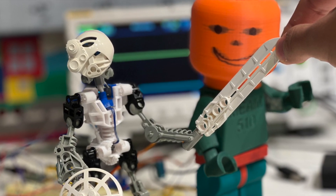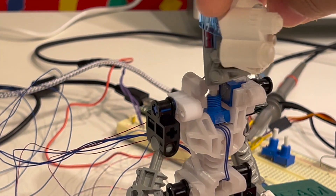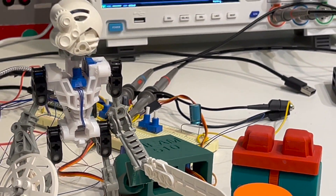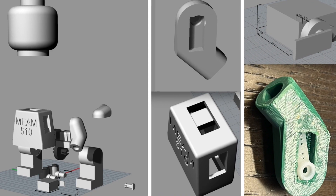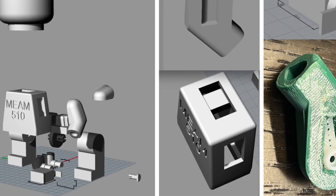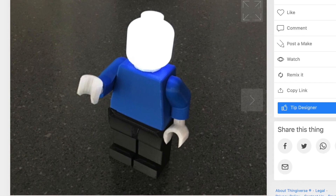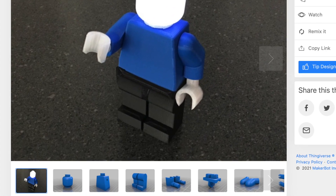Getting back to the project — once the Technic axle adapter to potentiometer model was completed, I 3D printed the torso to test compatibility with LEGO elements. This took a few tries since 3D printer tolerances aren't as precise as actual LEGO elements. With the input done, I then needed to 3D model the output, taking the standard 3D file for a LEGO minifigure from Thingiverse and importing it into Rhino, then scaling it to accommodate two servo motors.